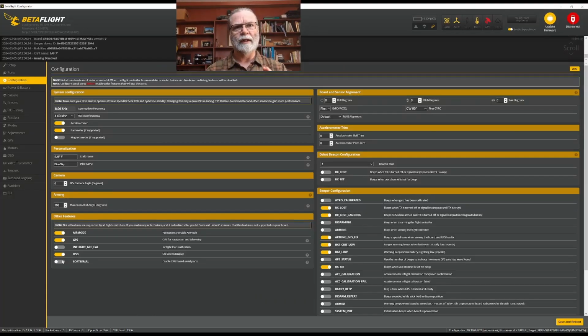And that arrow indicates the default direction of flight that the gyroscope and accelerometer expect from the factory. So basically when they put that gyro and accelerometer in there, they said, this way is forward. And in order for Betaflight to use the data properly, it needs to know which way is forward. So if for some reason, instead of putting this in straight forward like